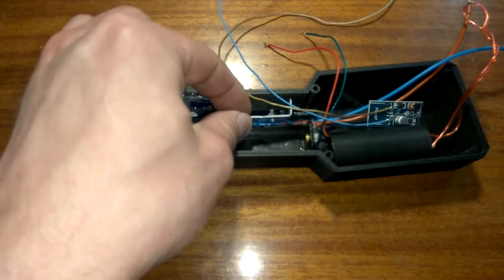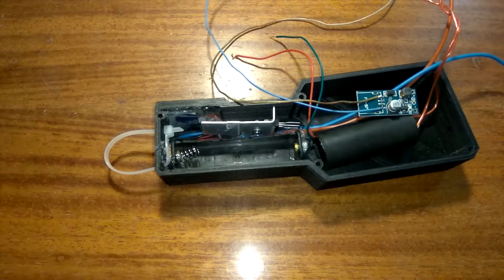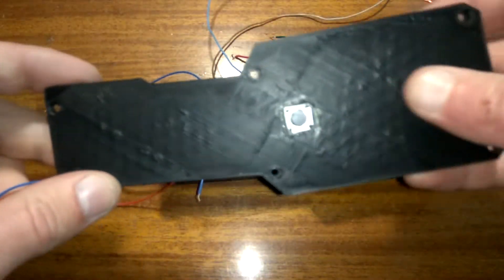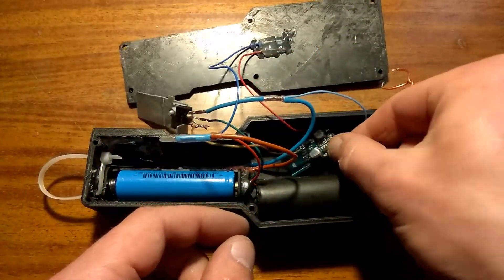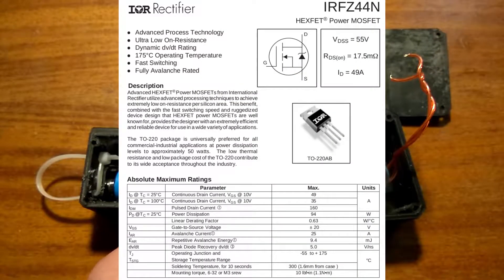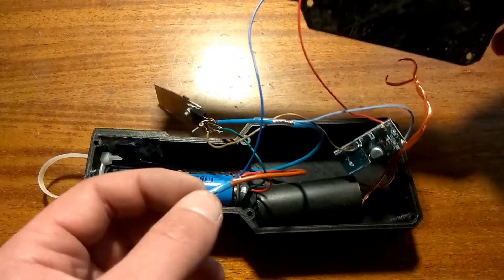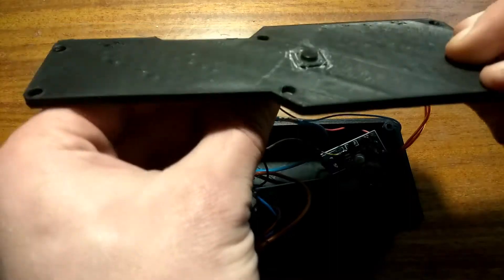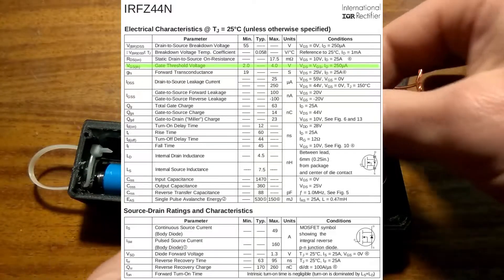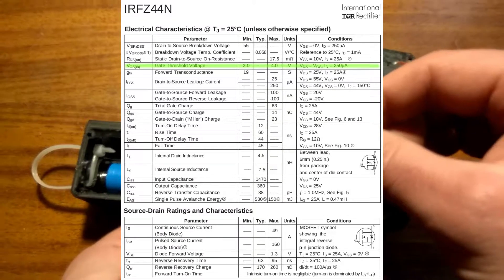The button itself is rated at 50mA, which is enough to turn on a boost converter that consumes only a couple mA. Of course you can use a big button that can handle bigger current, but these buttons are not very reliable, and it's better to switch a few amps with the help of a transistor. Any low-cost N-channel MOSFET that can handle some amps will be suitable. Particular features to watch for are continuous current — for this MOSFET it's 49A. The device itself consumes about 2.3–2.7A at 5V, and the initial current is of course a lot bigger, so some headroom will be good. Another spec to watch for is the gate threshold voltage. We need to keep the voltage at the gate of the transistor at least at 4V to close the circuit, otherwise the transistor will not be fully open and the current through it will be low. We can see this by looking at the handy graphs from the datasheet.